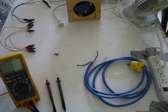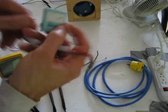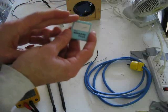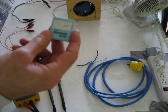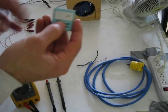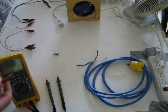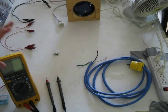Now let's add some protection to our circuit. I've switched the load from the lamp to the fan which I had mounted in the solar air heater. The protection we're going to add is a fuse. I have a fuse holder and a box of fuses. The size of fuse you buy is based on the voltage — make sure you get one rated for 120 volts AC in North America. The current rating of the fuse should be larger than the current your load will draw, but not too much larger. If there's a short circuit, your fuse will blow and protect the load. The fuse goes between the hot and the snap disk controller.